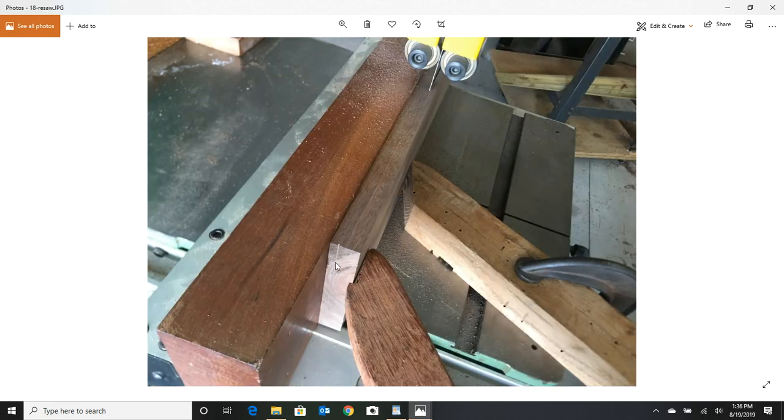I touch the board to the blade just to see what I'll actually end up with. When I get done resawing and put it through the planer again, my hope is to have half inch stock to work with. I'll also have some quarter inch — a heavier veneer — that I'll use for drawer bottoms, the backs of the drawers, and parts of the back of the unit.